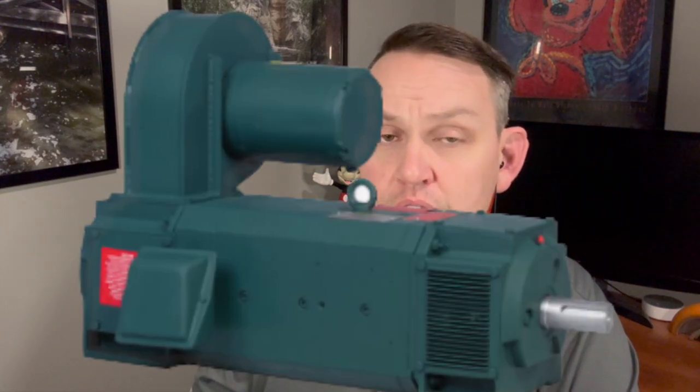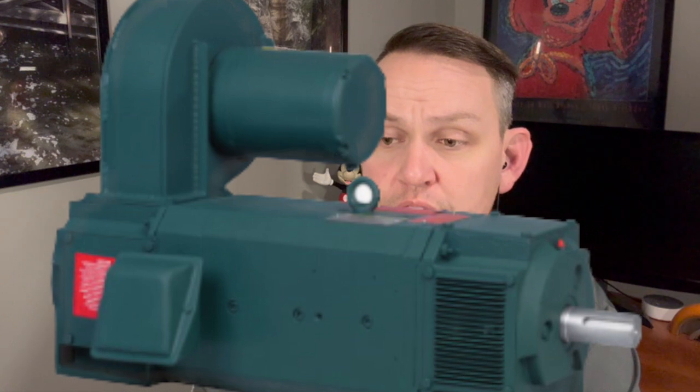So we'll move on now to lift motors. Lift motors are what does all the lifting in the ride. On a lot of newer rides, they typically use very large DC lift motors. And the DC is used for two reasons. Mainly, it's used because you can get a very high torque out of the motor, which is what lift hills need. They need a lot of torque. And you can also drive the thing very precisely.